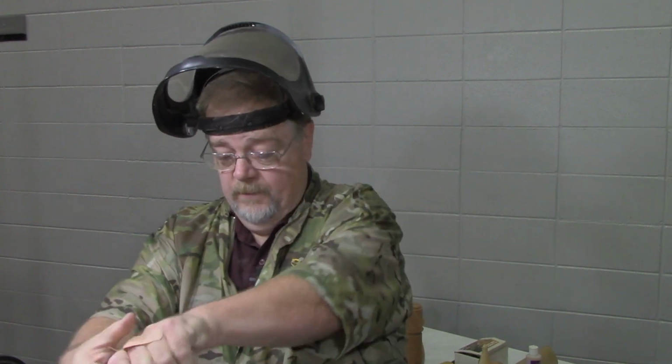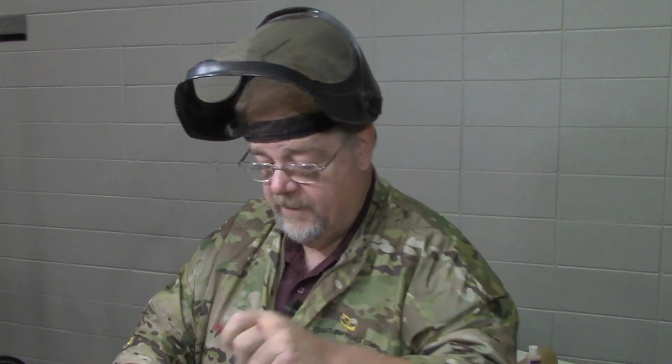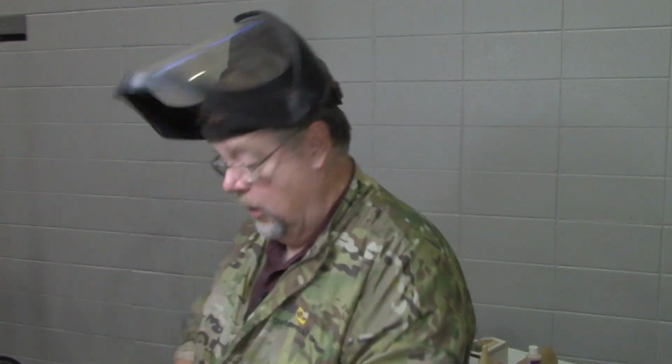I'm going to drill the body from both ends, and I'm going to drill the cap from both ends. Now, there are tutorials all over the place, and some of you have turned peppermills, and you may say, well, you don't have to do that. No, you don't have to do that. But what I don't like is when the drill bit drifts, and invariably it will.